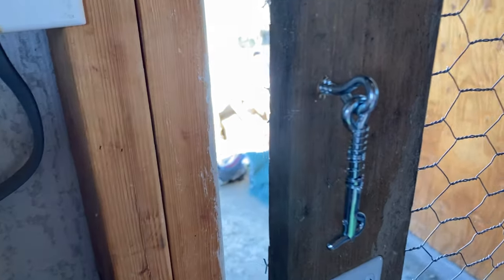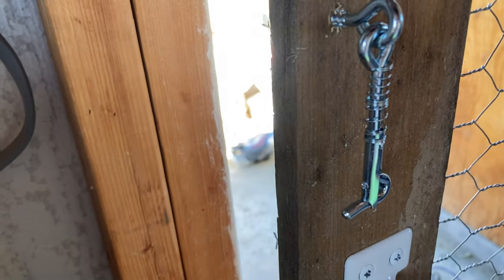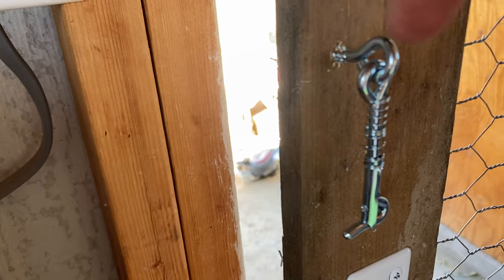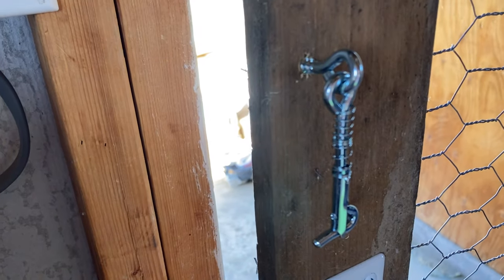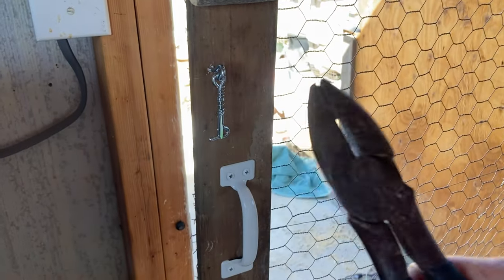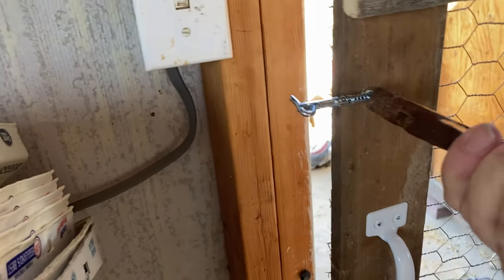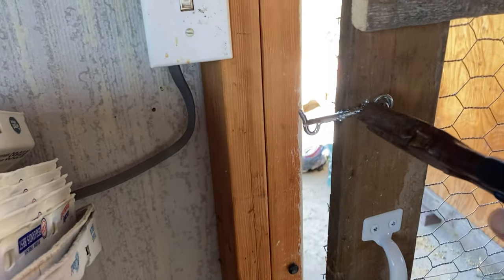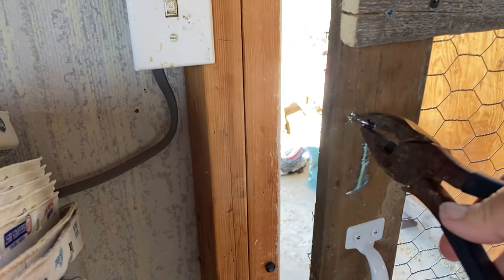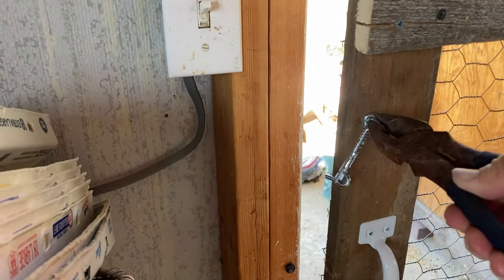I'm getting it started — putting that eye hook into the door part. If you don't drill it first, what I did is just drill a screw in there and then back it out. It makes it much easier for that eye hook to go in since the screw is a little skinnier. And if you don't have those big burly man hands, use some pliers — grab it and twist it with those instead. That way you're not beating up your poor fingers and hands. It's hard to hold the camera and do this at the same time, but you get the gist. It makes life a lot easier.